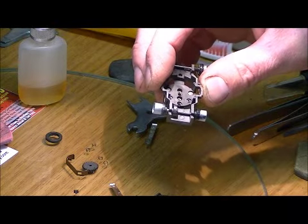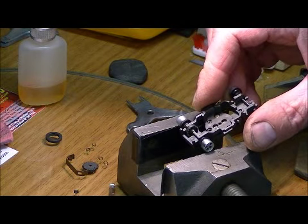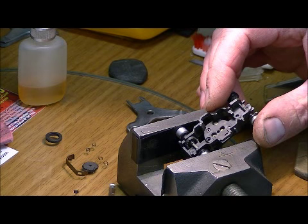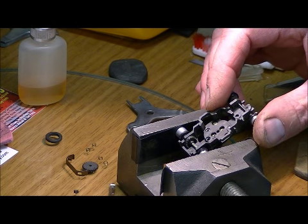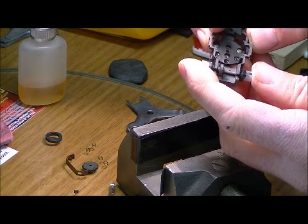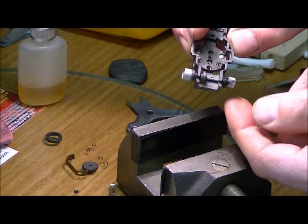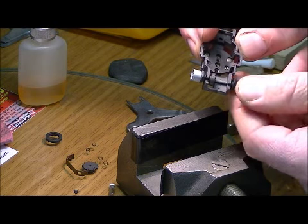What we're going to use for that: we're going to very gently clamp this in the vise. Keep the wheels straight so that everything is square, and slowly press the wheel back down on the axle. Check it periodically to see if you're getting the play out of it. We want a very minimal amount of play, yet the axle turns very free. That's what you want — very little play and turns free.